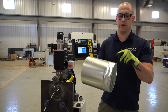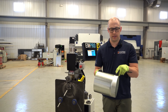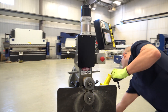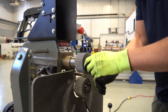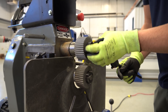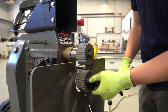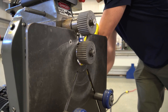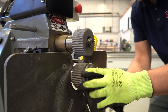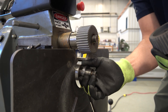Now that we've shown you how to set up the standard light gauge crimp rolls, I'll show you how to install the modified bead roll that goes in tandem with it to do combination bead and crimp together. The first step here is to turn off the machine. We're going to open these roll nuts — sometimes they will loosen themselves over time, and that's okay. The modified bead roll is the second set of rolls that go right on top, but we have to take the spacing collars off first.